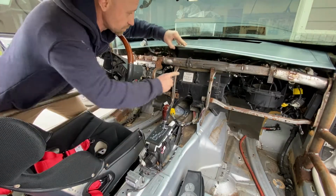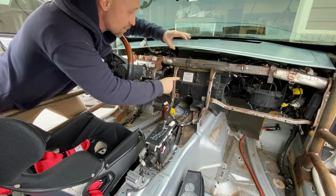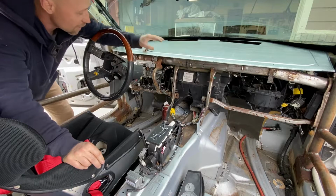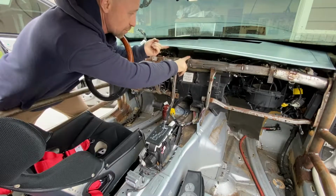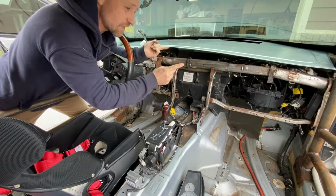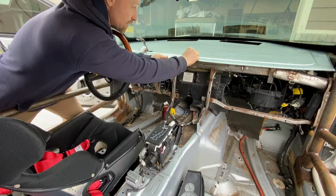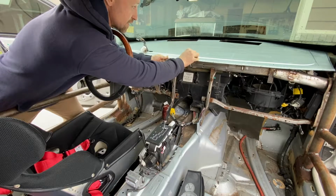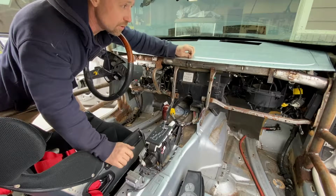So with that, I welded on these little dash extensions and put a riv nut in the top. I ran a string from each one of the A-pillar bars and that gave me a plumb line to where I could put all of these holes on the same height, kind of X, Y, and Z axis. Then, just using three nuts or three bolts, the whole top goes together, gets secured, and turns into the mounting for everything else. So, I would say overall, this works pretty well.